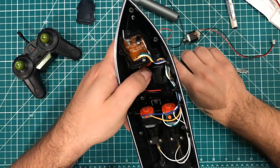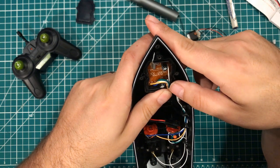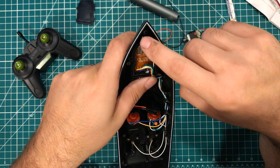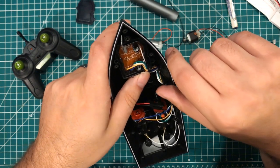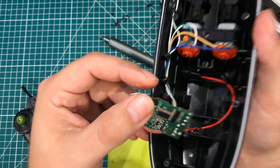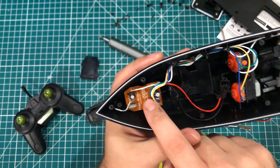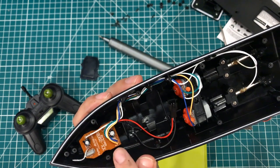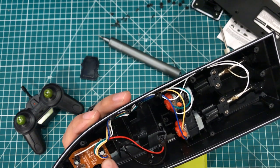Okay, so this is the Fly Tech RCToy.com XX239R, revision 2025-18. We've got a couple of caps, a crystal oscillator, and an antenna. Unfortunately I wasn't able to find any information about this microcontroller — I tried the FCC, tried looking it up separately, and everything on the back of it is scrubbed clean. But we can figure out what it's doing: it's receiving signals from the remote, sending some kind of signal back, and possibly modulating motor speed based on what it receives.